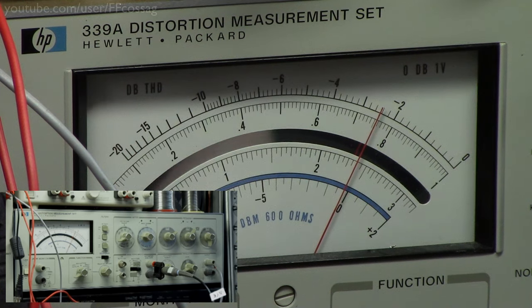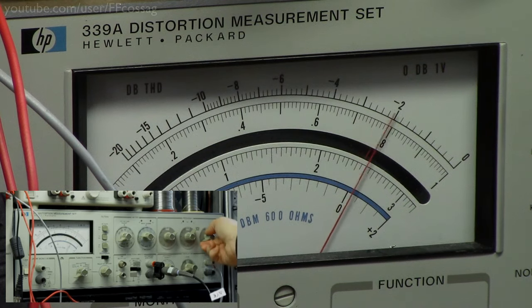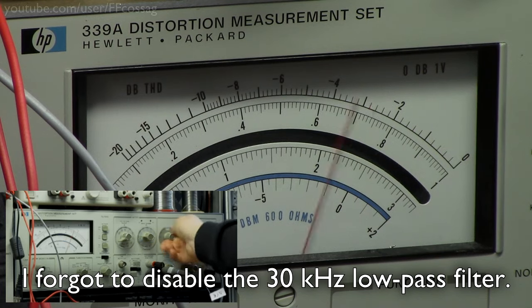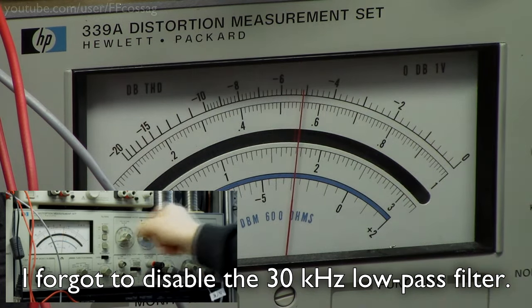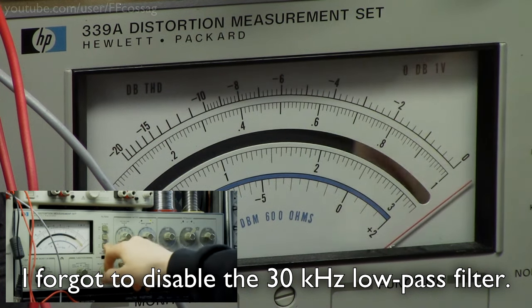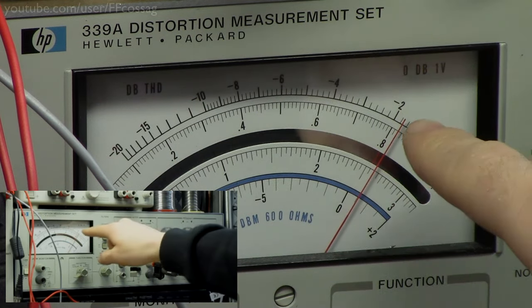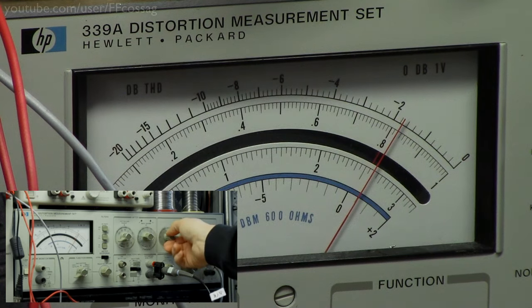So we've actually got a better low frequency response out of the front channels than we do the so-called subwoofer channel. That's an oddity. So the front channels certainly are full range on this thing. Let's check the high-end response on them. Let's just start at 10 kHz. And we're down 0.8 decibels. 20 kHz, we're down just about 3 decibels. And now, let's just change to a better low-pass filter. Yeah, that's more fair. We're actually up 0.2 decibels at 20 kHz, so that's not too bad.